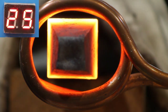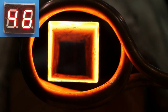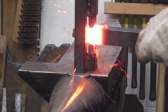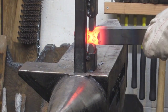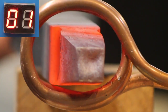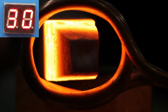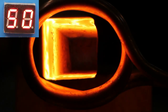I'm going to make a mistake with the fuller ring. I didn't want it to be fully inch and a quarter, because my hardy hole is one inch - I wanted maybe inch and an eighth. So I went to near the edge of the taper and started the fuller ring right there. Well, I didn't account for the fact that there will be some drawing in - it kind of sucks in at the edges and that narrows it too much. Which works out fine, because my other anvil, which is a Wilkinson, has a seven-eighths hardy hole, and this one is going to be perfect for that. We'll make another one with the coal forge, and I'll make sure to put the fuller in the right place for that one.